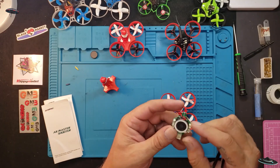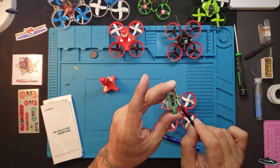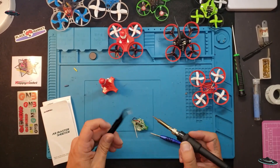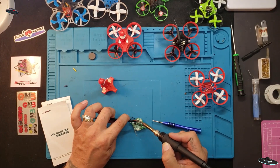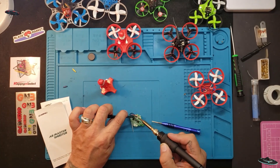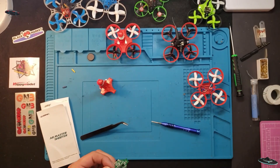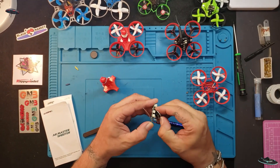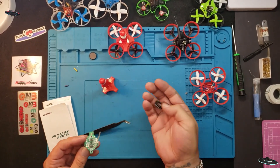So this is the speaker I was talking about. We just need to remove this guy — it's got double-sided sticky tape holding it on the bottom of the board and we need to desolder it right here. I want to have my soldering gun ready. We'll just get rid of this real quick. See, they're desoldered. Make sure you clean your tips and your solder gun every time you solder. We'll just peel this off the back, and you're speaker free. This thing loses quite a bit of weight too — now you have bare board.